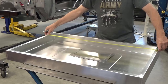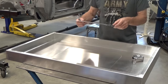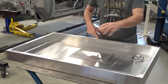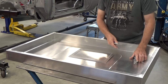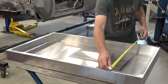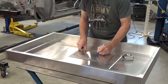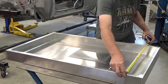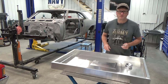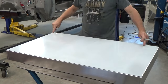The front panel is 42 inches wide and 26 inches tall, but there's a little step in the flange that takes up about an eighth inch, so I need to subtract an eighth inch off each side — that's a quarter inch total. So that means I've got 41 and three-quarters inches wide and 25 and three-quarters inches tall. Pays to measure twice, cut once.